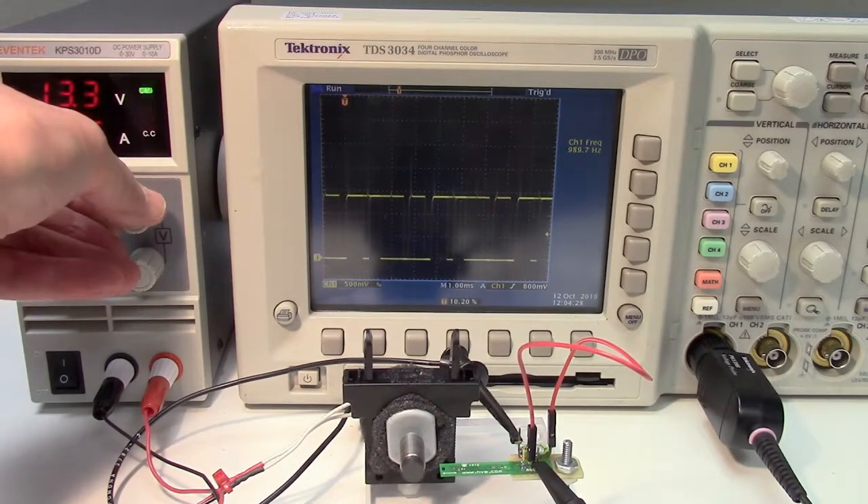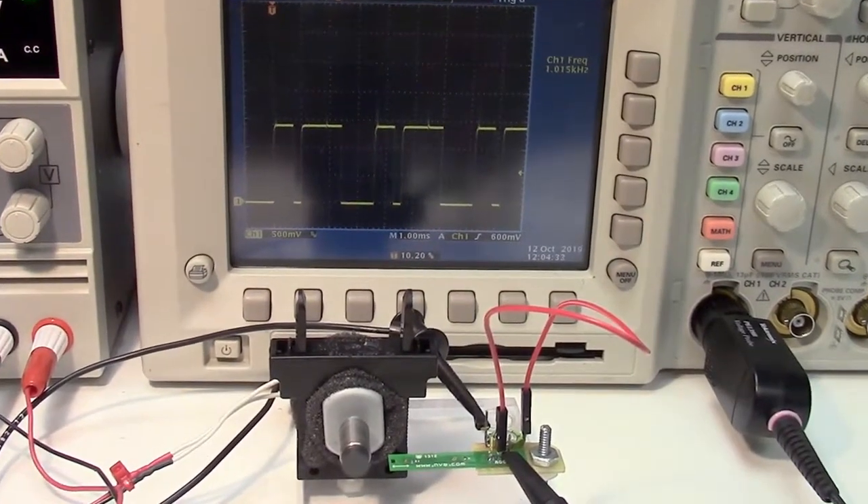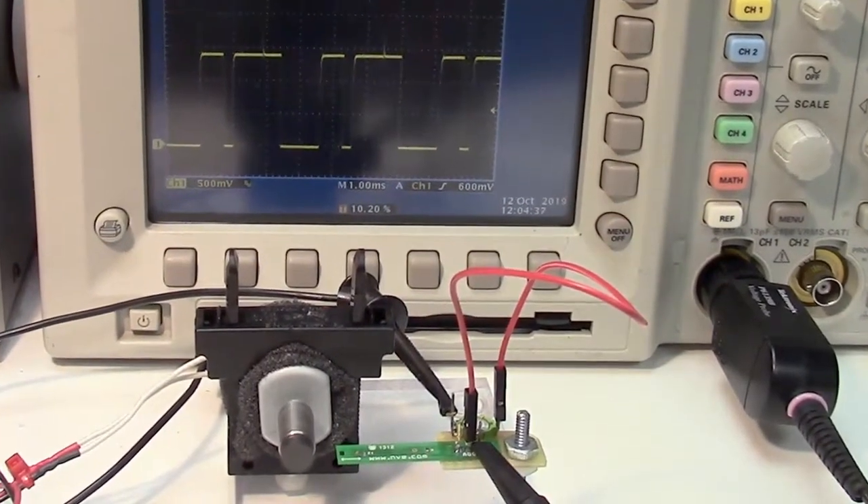At the maximum motor speed and with the asymmetry, we need a switching speed of more than 1,000 Hz. This requires a high-speed sensor, so don't try this with a duty-cycled sensor.